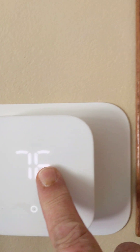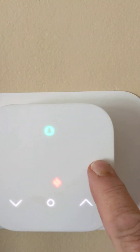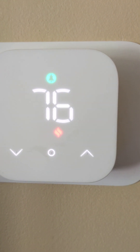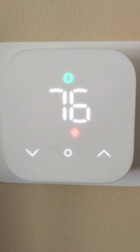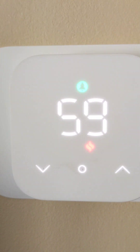That's all there is to it. You run two wires from the thermostat down to the burner and put them on TW and TR — it doesn't matter which wire goes to which terminal. Then run another two wires from your transformer — it'll say AC AC — over to the Amazon thermostat on C and RC. The two wires from the Beckett burner go on R and W, and you're done — it works perfectly. Sorry I had to do this on my phone, but that's how you wire an Amazon thermostat into a two-wire Beckett furnace here in the northeast. Leave any comments down below — thanks guys!